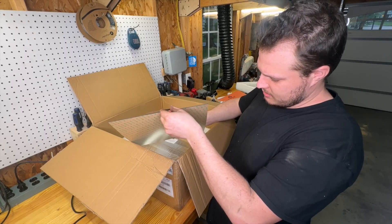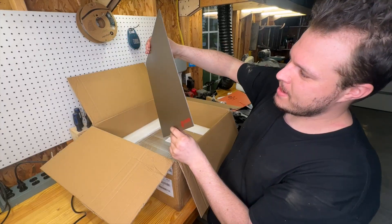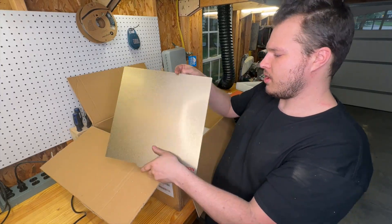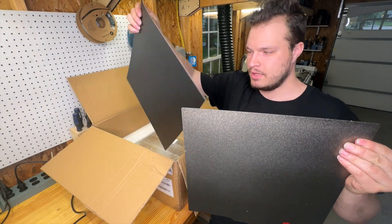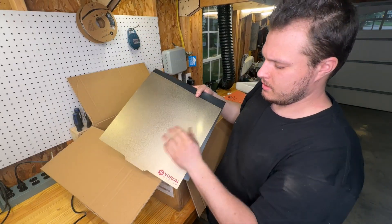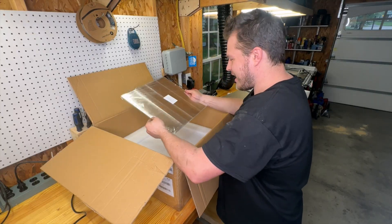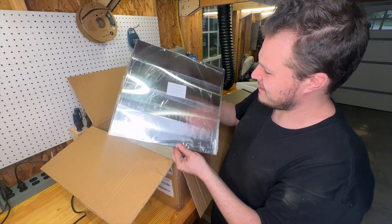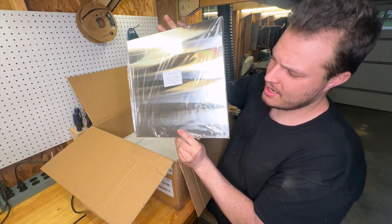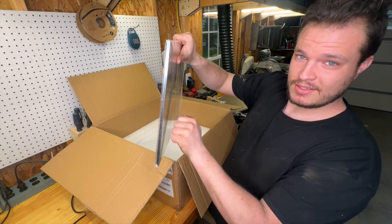Here's a big PEI-coated spring steel flex plate — it's really heavy, which I think is due to a thick magnetic layer on the back, and it has the perfect springiness. It magnetizes to the bed and peels off, and you stick the magnetic layer permanently to your aluminum build surface. The aluminum build plate itself is the shiniest piece of metal I've ever seen — a very high-quality, smooth milled aluminum plate, probably cast then milled so it doesn't warp. It's just a very solid-feeling piece.